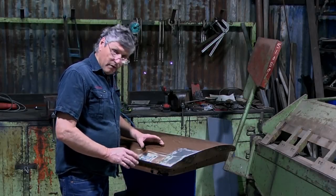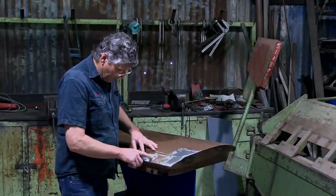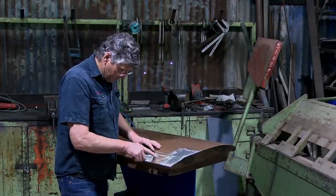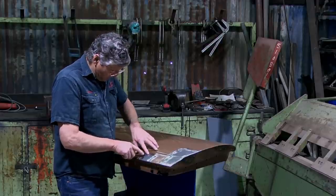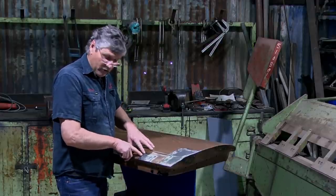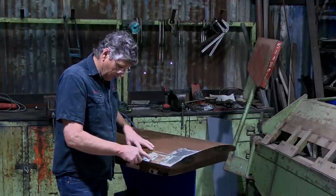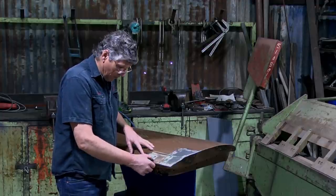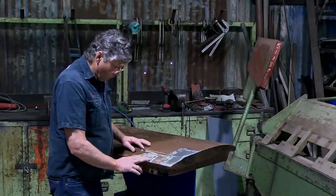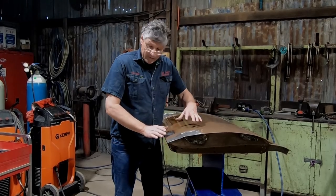I've got our weld done and ground off. Because this is a lap joint, we're not going to get the weld to disappear completely, so we're going to have this little shadow around here. The edges we bent over a little bit — we've almost got a smooth line across here. This one we did nothing to has that shoulder on there, and there's still a little depression next to the weld and up to the fold, but that's within the realms of fillable. What we have got that is an issue from where we quenched is this metal high spot through here where it's dragged it out.